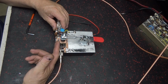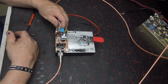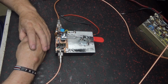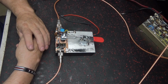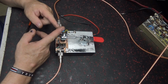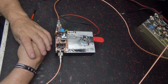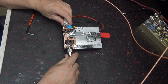But if you're fixing one and you want to figure out if it's a good transistor, if it's got a short, this, that, and the other, you'll tell. But you can also match a couple used ones. I've done it. I had some that tested okay, but it didn't look right in circuit. So I'd take them out and put them in this, check it, and see what I had, just to make sure, like this one was putting out 150 and this is only putting out 120. They'd be fighting each other, and then I'd just grab another used one where it's 150, 150, or 120, 120, and it just gives you like a little dyno test of a transistor. So there you go. Hope you enjoy it.